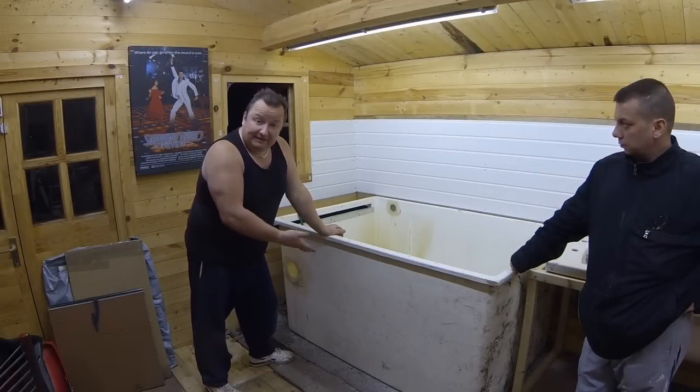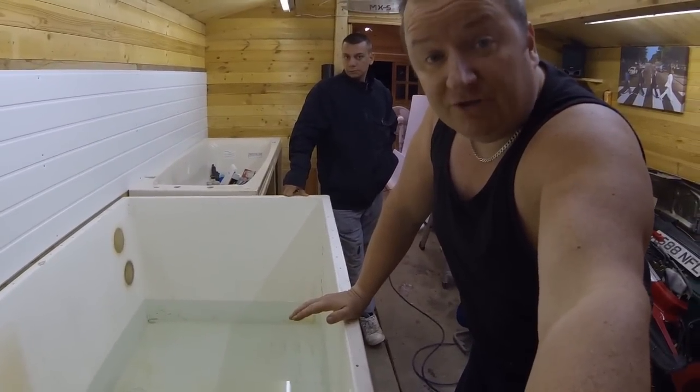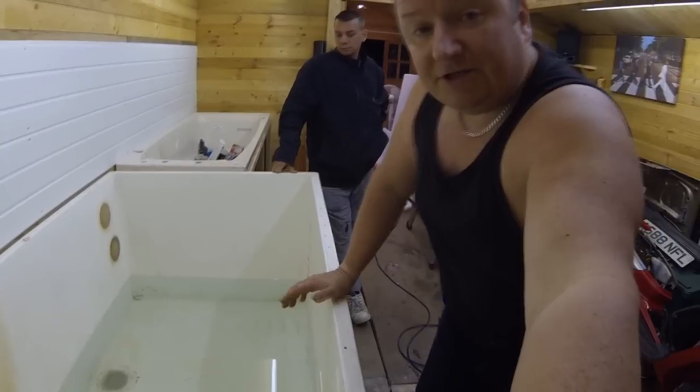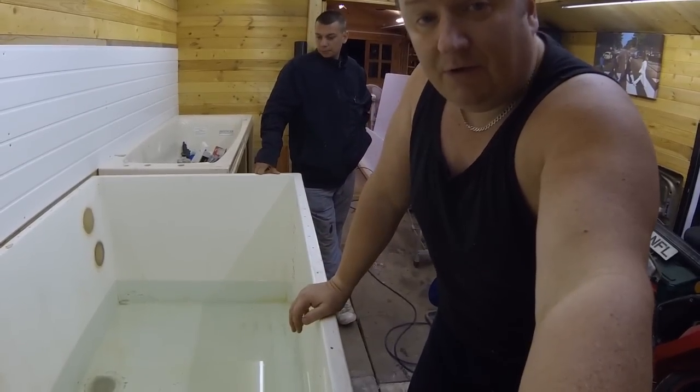We've got to hold fire - we're half an hour into filling it up. Our waste tank connector down here, let's show you. That thing down there between the tank and the tank fitting itself is basically leaking. So we've done nothing else - we've got to actually, as you can see there, I thought it might look a bit dodgy because it didn't pull up square. We're just going to have to drain the water out, take that off, and we're going to have to silicone that in as well. So it's a little bit of a setback. What it basically means is that we won't be filling it up on camera tonight. You'll probably see it up to level tomorrow morning because we've got to let the silicone go off overnight. So anyway, we'll end the video here. I hope you enjoyed this little one, just so that you can see we've made progress anyway. See you again in the next video. Hope you enjoyed this. Bye for now.